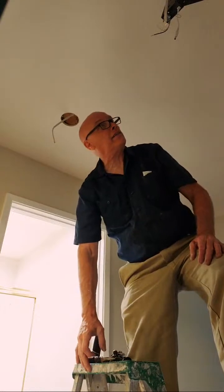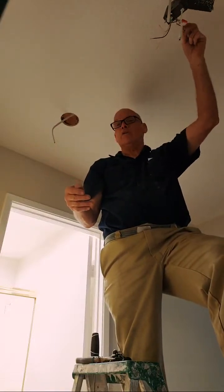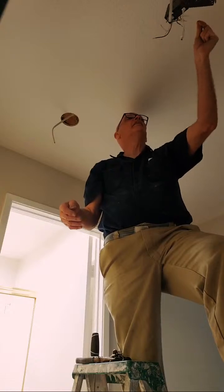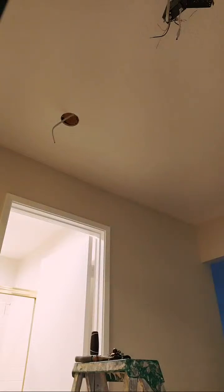Now, it has these orange wire nuts in here. And obviously now that I'm adding more wires, this was fine when it was 12 gauge and one, I think that's probably down to 18 or something. Yeah. And that was perfectly fine for that. But now I'm going to have two 14 gauge and one 18. I'm just going to bump these up to the next size up. And I like using these, just Klein wire nuts.